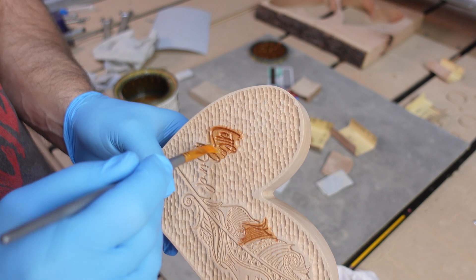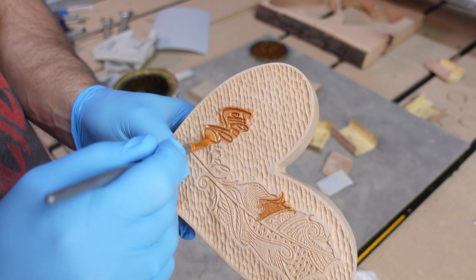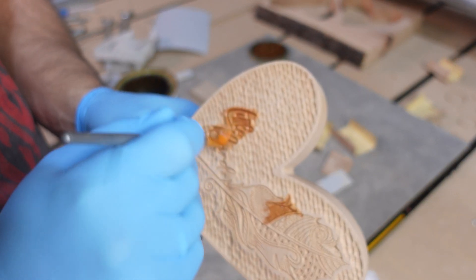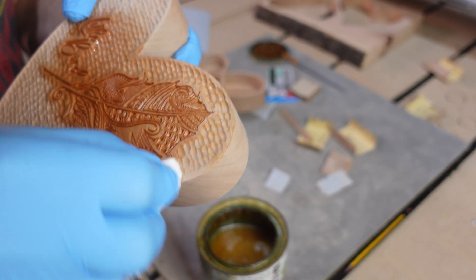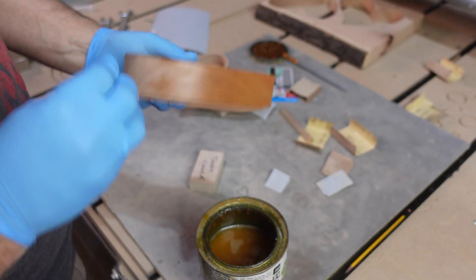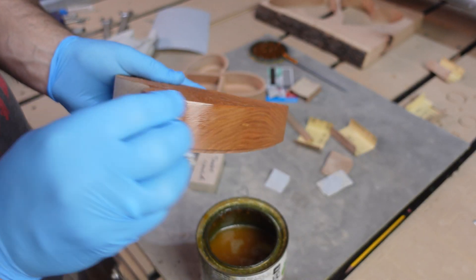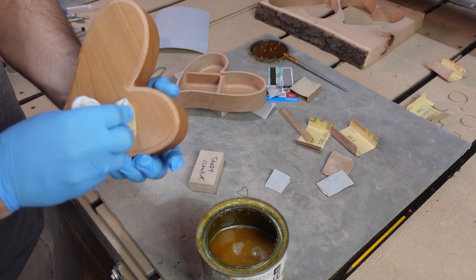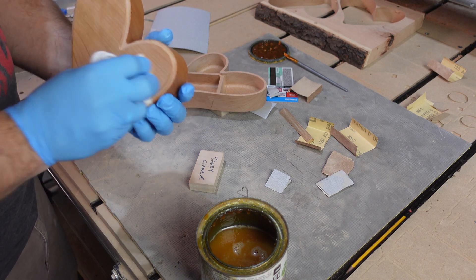Now it's time to bring out the beauty in this wood. I reached for my old buddy Ligna. I did some testing with some other products to see if it affected the color or anything — it brought out the grain a little better. And Ligna just... I probably could have used a wax to be honest, but to get all these little details it was going to be a bit of a pain. So I'm not going to lie, I lazed out and used a liquid — something that would get into these little grooves a lot easier. And Ligna has always just been a really great finish for me. We're not paid to use it, they aren't sponsoring us or anything, but in my experience it's just worked really well.